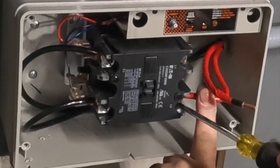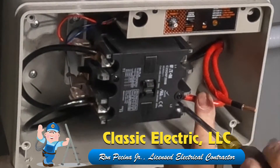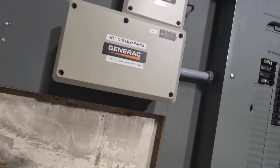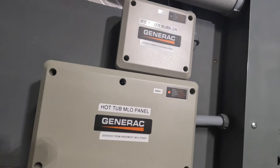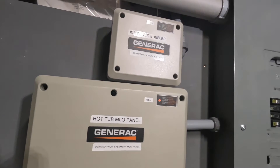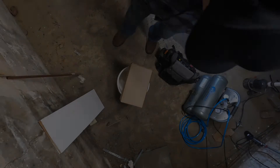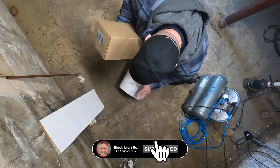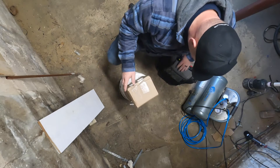What this device does is it sheds electrical loads that are too powerful for the generator to start at that particular time. Once the generator does have the availability to start the large electrical load, a set of contacts is closed and the circuit is complete, and the load is supplied with power from the generator. This home has natural gas, so a lot of appliances in the kitchen are connected to natural gas.